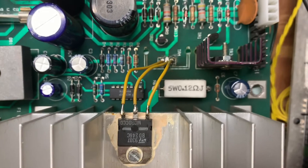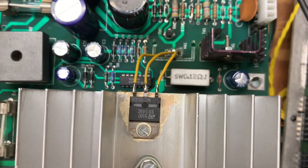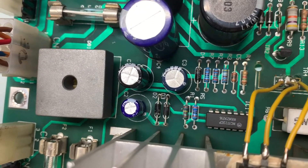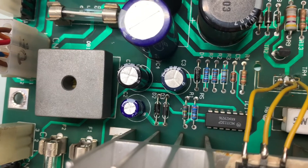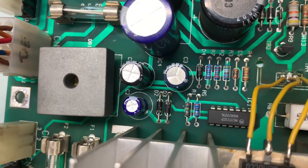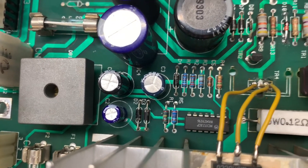I hate to ruin this creativity and not really gain anything. I've replaced these three capacitors that you see in the center of the image right now. C2 had corroded, as you can see in the original picture I rolled in, and it damaged a trace between C2 and D2.